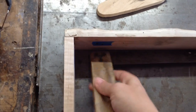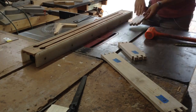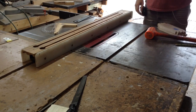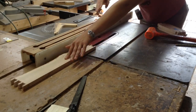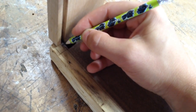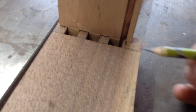The extra nice thing about joints like this is when you dry fit them together, they're usually pretty square right off the bat, and if they're not, they're very easy to get square. Once I had this in place, I made some marks and cut a quarter-inch groove on the bottom of three of my pieces. That would leave a little gap on the back side of the panels, but it didn't matter because you'd never see it since the drawer would be set inside the table. Once I had that done, I reassembled the entire piece and marked on the front of the pullout drawer where that groove was going to be.